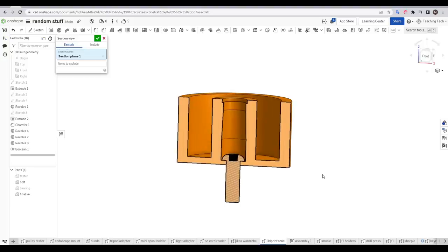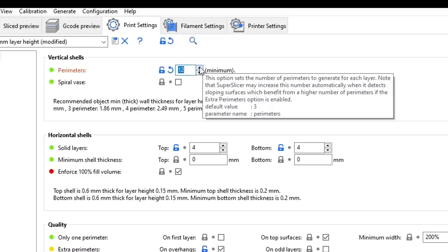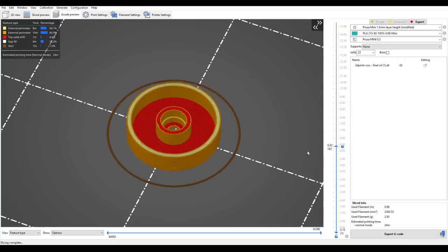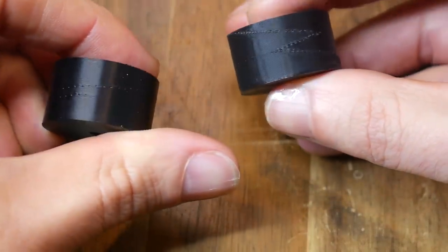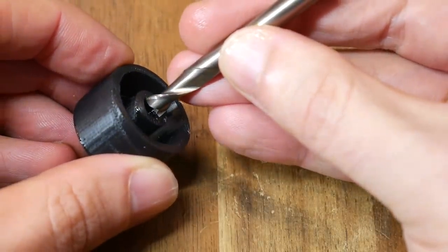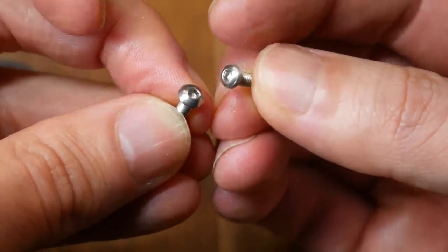A section view of the model hopefully illustrates more clearly the way everything will be held. The next step is to print our oversized wheels in PETG as well as Apollo X. I wanted the wheel to be completely solid, but rather than change the infill percentage, I upped the amount of perimeters, resulting in a solid model with a very nice concentric infill. The PETG model on the right has some fine stringing, and both models share a visible Z seam — the type of wall artefact that gave us issues in the past. The printed lip on top was just about ideal for locating the 6mm end mill, however the gap wasn't quite big enough for the bolt, so my solution was to grind down a bolt until it could pass through.